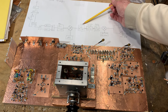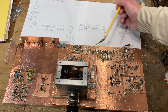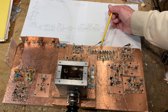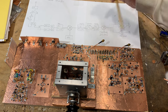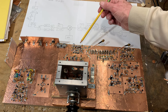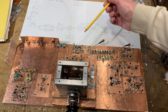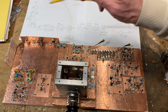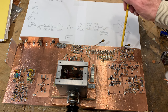From there it goes up to another TIA set at about 23 dB, then through the filter and out to another TIA. One issue I have to work on is impedance matching. When I built this TIA using this filter with these crystals, the software said the impedance required by the filter is about 25 ohms, and the TIAs are at about 50 ohms — close enough perhaps. I'll hook everything up, power up the TIAs, and take a look through the nanoVNA to see what the passband looks like. If there's not excessive ripple, I may leave it without worrying about impedance matching.